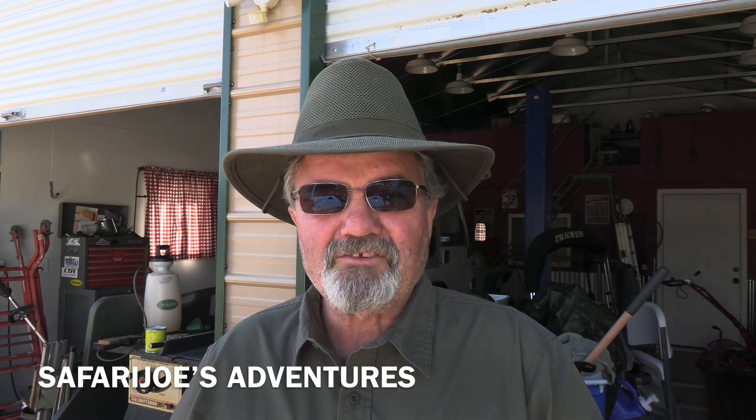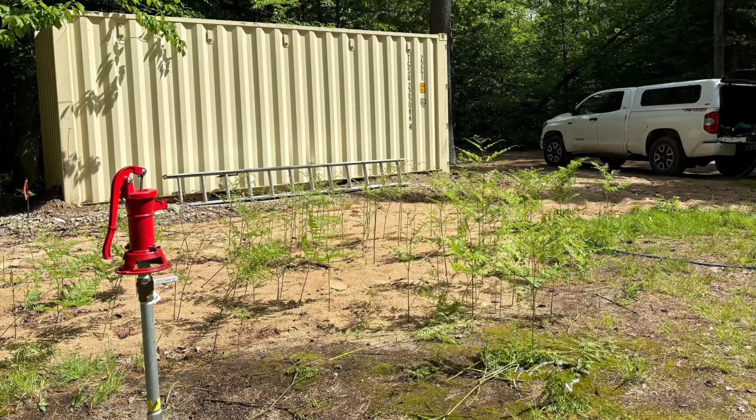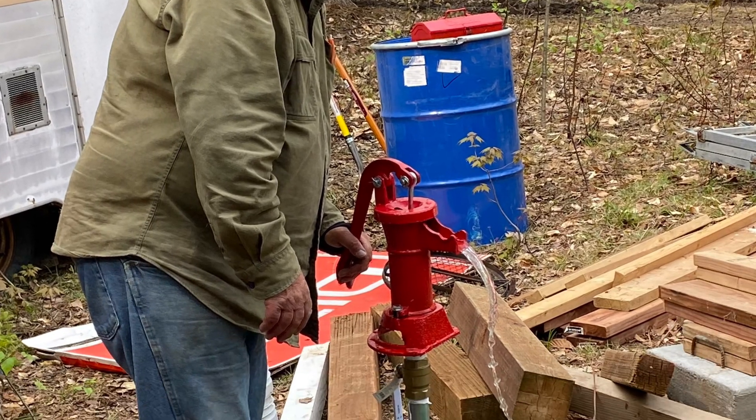Good morning everyone and welcome back to my channel. Two years ago I bought an off-grid abandoned hunting camp. This is a dry cabin, which means there's no water in it. Fortunately for us, it did have a hand pump well — it's a sand point well, inch and a quarter, 25 foot deep. Inside the old cabin they had an old broken pitcher pump that didn't work, so I went down to Menards, picked one up, tried it out on the well, and lo and behold it worked. It has water, and it's good water — I bought a testing kit and tested it, nothing wrong with that water.